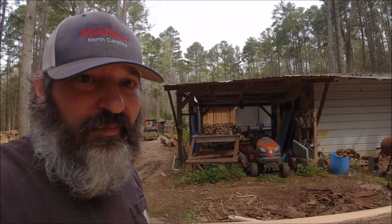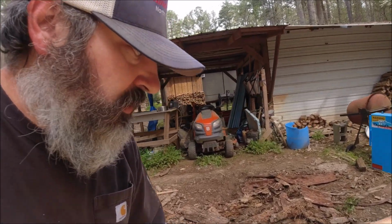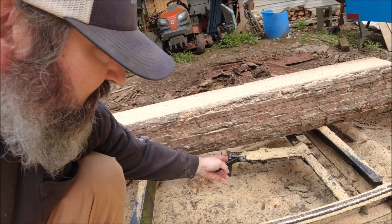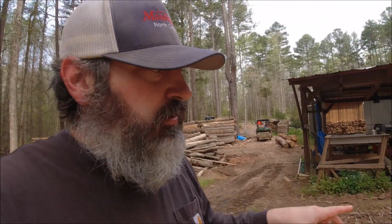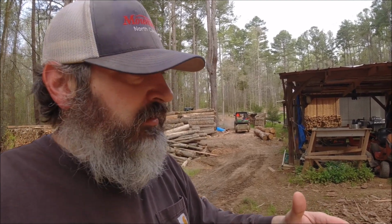It don't take no time to make these 1-inch boards for siding. One other tip I'll show you, if you have a similar setup as me with this style of log clamp, you can see that my log clamps here, they don't do well on the curvature of the log. So keep your boards on there, don't just offload them as you're going, and keep the weight on there, and you can get that last cut when the clamps are off without the log going all over the place on you, because it will try to drag it.